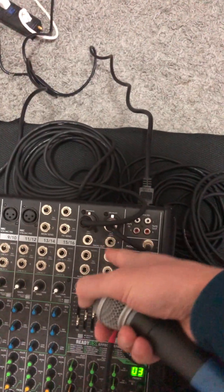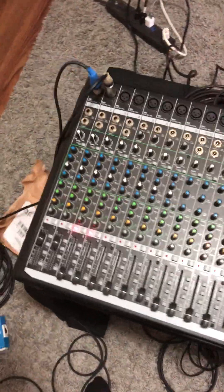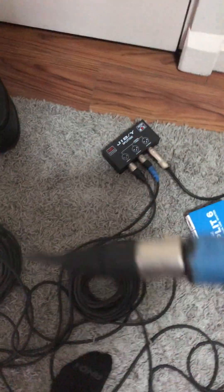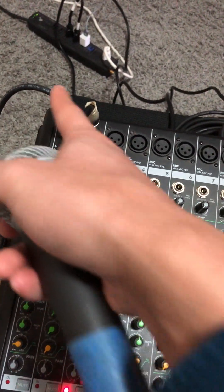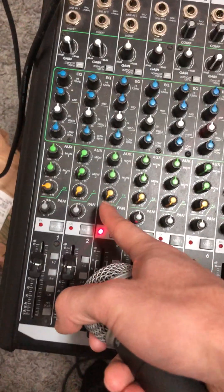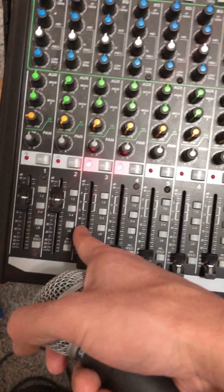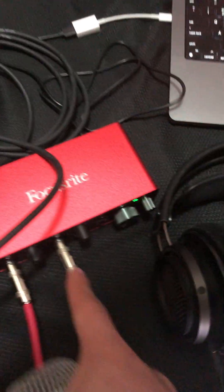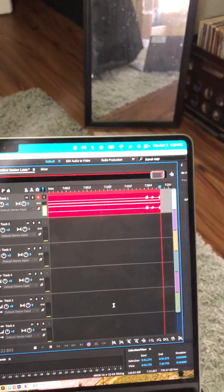To summarize the entire setup: have your normal XLR cables going to the PA, make sure left/right is set normally as always. The only difference now is that you're splitting the signal so you can have a recording mix and a PA mix. The PA mix is here, the recording mix is here. Always make sure effects are all the way down for the recording mix, make sure sub 1 and 2 is pressed down and left/right is not pressed down, and confirm you're getting a signal through here for the recording — and we are.